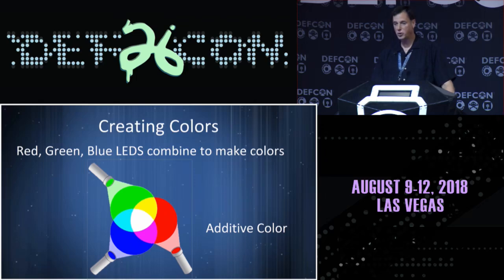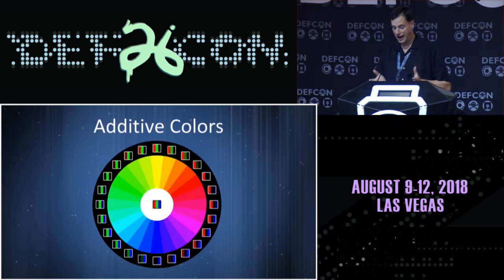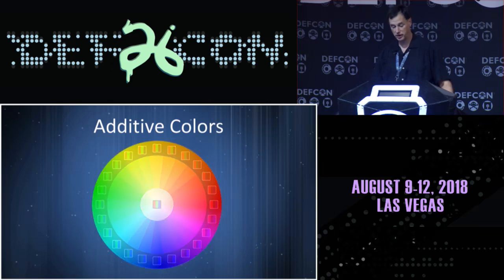So what they actually do is like shining three flashlights together. So you make additive color. By varying the intensity of each of those three colors, you can create across the spectrum and add together to get almost any color in the visible spectrum. You can go from off all the way out to all three on gives you white, and then you can get in between the various shades, and the software controls all of that.